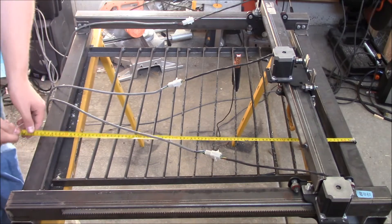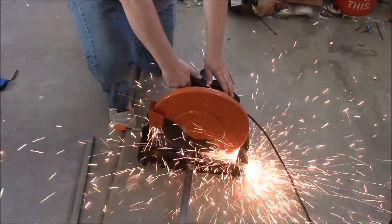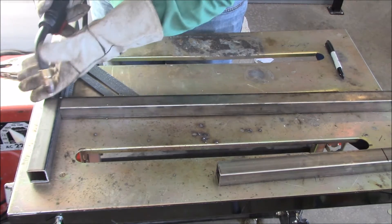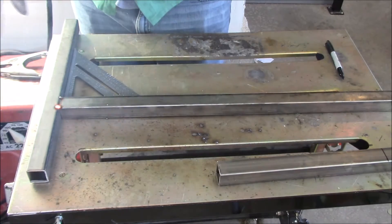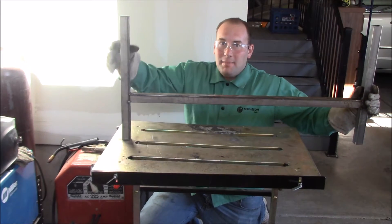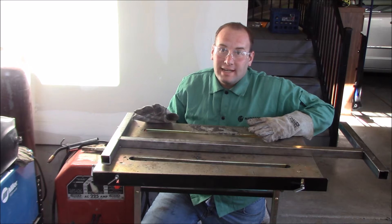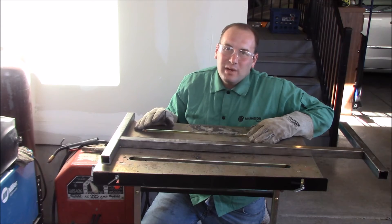I'm adding three quarters of an inch to the width of my plasma cutting table to make my cart, so I'll cut the wide piece at 35 and a half inches. For the depth of my cart, I'm cutting two pieces of tubing to 18 inches long. I'll go ahead and tack those in place. So I got the first piece all tacked up — it looks like a big H. I'm happy with it and I'm confident in my dimensions, so I'm going to weld it out. It's a decision you have to make on every project: whether you're going to tack the whole thing together and weld it out at the end, or weld out parts as you go so it's a little simpler.